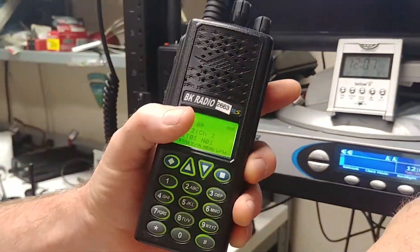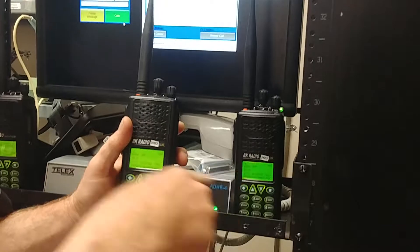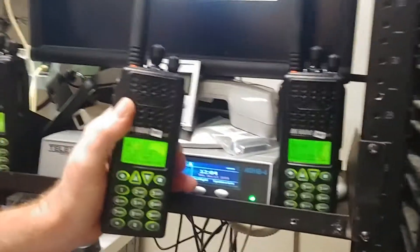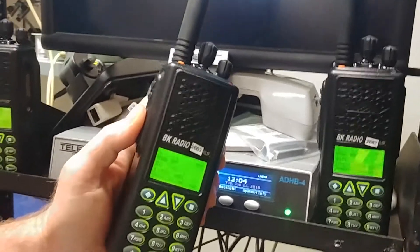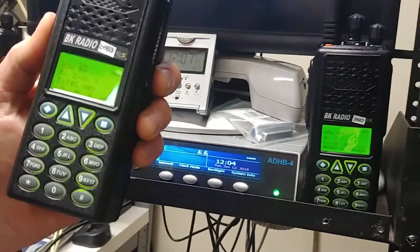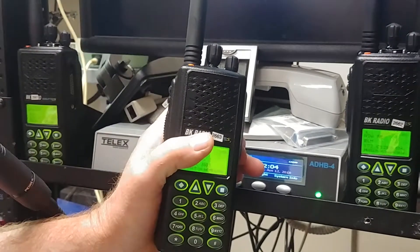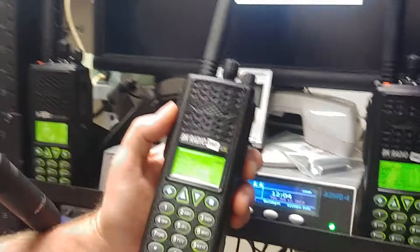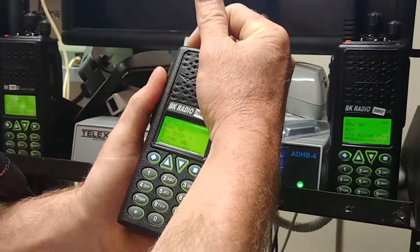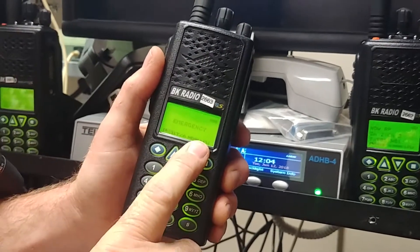So now I'm going to show you what happens with the emergency button. Can you see all three of these radios here, or just at least two of them? So what I'm going to do right now is make an emergency call. Right now I'm using analog — you can see test, test. It's an analog call, so not all the information is on there in the call, but it records things and shows when the calls came in. If I hit emergency here, it automatically switches my channel and puts me in emergency mode.